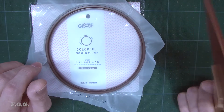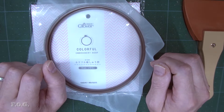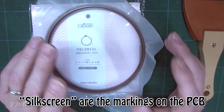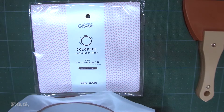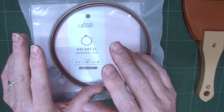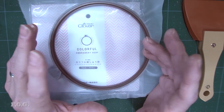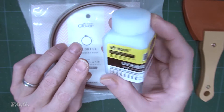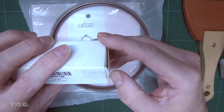So I'm thinking of a couple of things: one is to put the layer on and see if it's usable to burn and lay down the pattern. But I also had another idea — I could lay down an entire layer of white UV resin, remove it before exposure, move the PCB to the laser on the CNC, and actually expose the pattern directly. Those CNC lasers are around 450 nanometres, and these resins apparently cure at around 350 to 400 nanometres, so I don't know if that's going to be close enough.